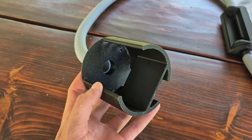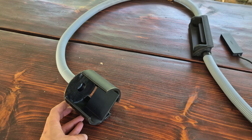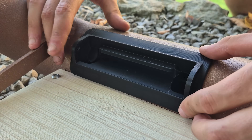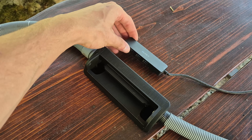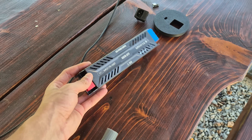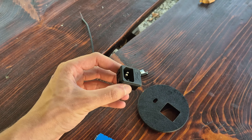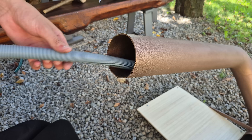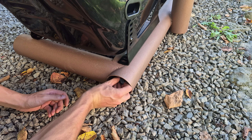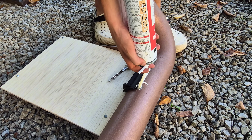To mitigate this I made a few 3D printed parts which get connected with flexible tubes to allow the wires to be internally routed. The middle section will be slotted beside the pedal tray and will house a USB hub to which the pedals and wheel will be connected. The power supply will also be mounted internally with a cap at the end of the tube holding the power socket and USB-C port. The whole point of this cable routing system is so that after installing everything inside the cockpit, the internal volume can be filled with polyurethane foam to dampen all unwanted vibrations.